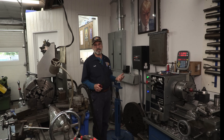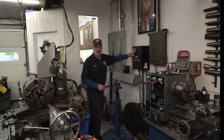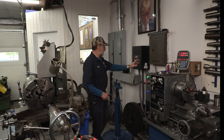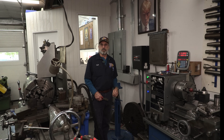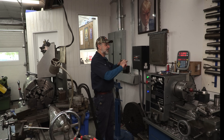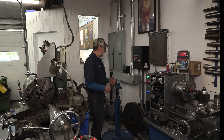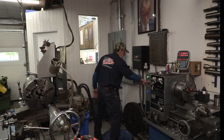So from now on you're not going to hear any phase converting going on in the background. I'm getting ready to take down all this phase converter, and then I'm going to drop the leg from the old panel over to my single-phase side of the panel. I've got to put a jumper in, and then it'll be 100%. Once this whole wall is cleared out, I can gain a lot more usefulness of this wall.